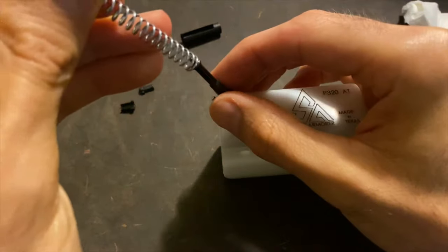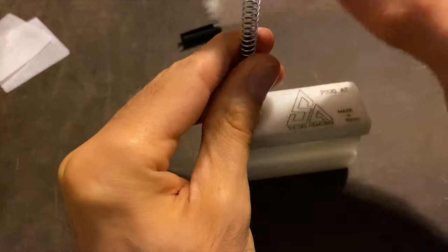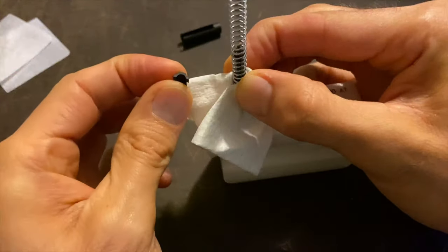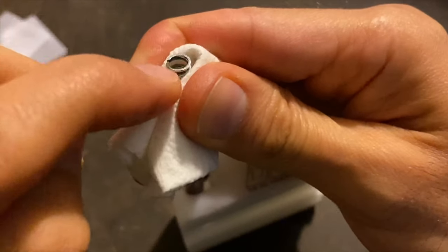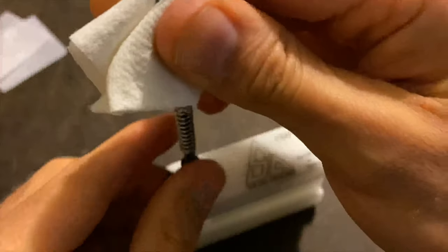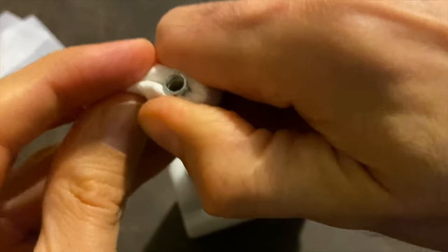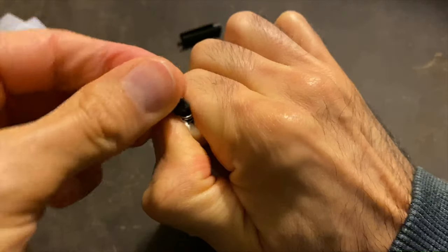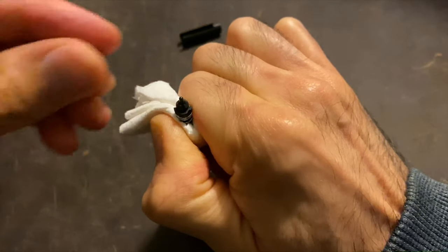Put the spring over the firing pin just like that. Using another piece of paper towel, compress this all the way down — probably about to here — and then take the cups and slide them in. I try to grab the spring from here because you need to get the cups in underneath the lip where the firing pin is. Wrap it around, start compressing, and once we get to here we can start slipping the collars in like this, then get the other one in on the other side.